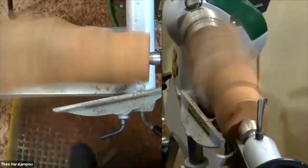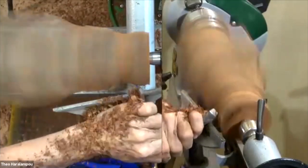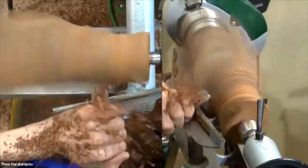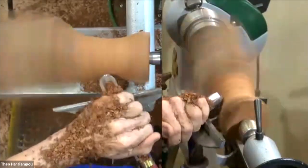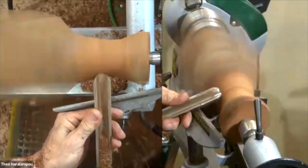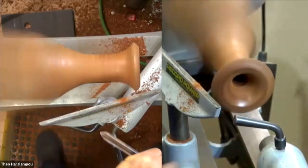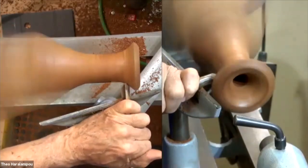For those of you wondering, I'm at about 900 RPM. The main thing is I don't catch it on the other side. It's turning beautifully on the inside once you get down. Let's have a look at the overall balance — we can now start to look at the shape we're forming. With the bowl gouge, you just pick it up and roll the gouge and it starts to cut.